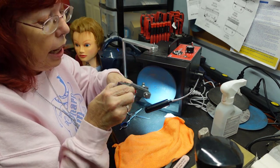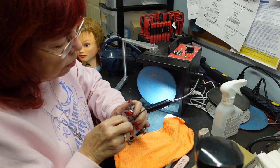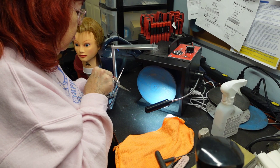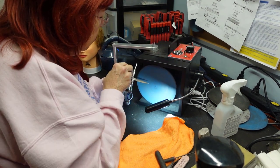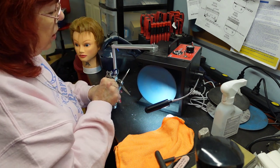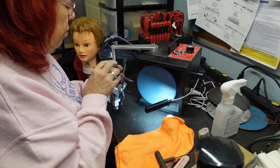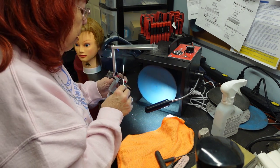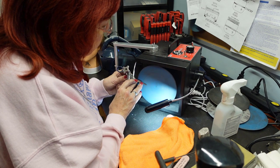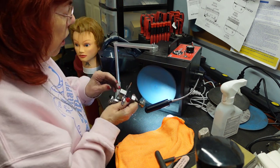All right, so try one more thing. Had this set at 45, which is supposed to be the right angle for these, but I'm going to pop it down, not all the way to 40, but maybe 42. Sometimes a little blunter angle will work. Sometimes it's just getting them to cut in some way, some form, some fashion. And these are old shears, like we were looking at, they were pitted. It may be this is all we can do to them. Told you I thought I was going to have problems with the tip, but not so much. It's just the whole blade.